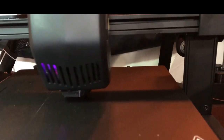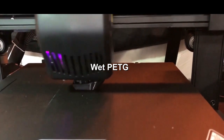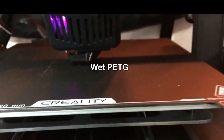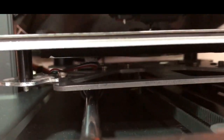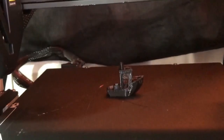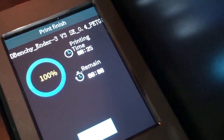This bridge is going beautifully. The only complaint I have is that the filament is a little bit wet, so you're getting a little bit of stringing and some artifacts on the surface of the benchy, but other than that it looks great. It printed in 25 minutes instead of the 28 minutes, so I gained a little bit. Here you go guys — 25 minutes.